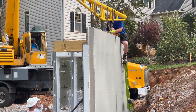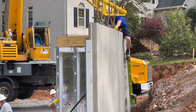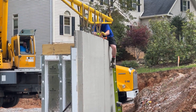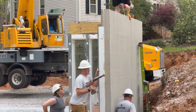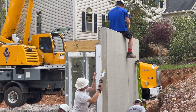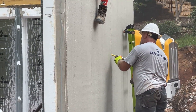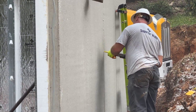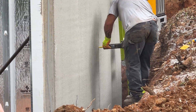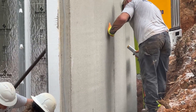The panels also have steel rebar and wire mesh down through the concrete that tie into screw-through bolt holes where the panels are then lagged together with bolts. Here the set crew is installing the center layer of polyurethane sealant — one nice heavy bead down the center of the panel. Here's the outside layer going in between the joint. They are generous with the amount of sealant — that joint will be completely full and then tooled smooth. That's in addition to the bead in the center of the wall and another joint of sealant that will go on the interior.